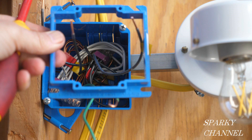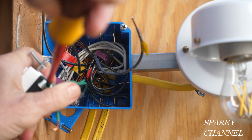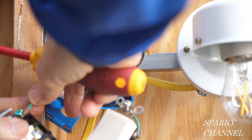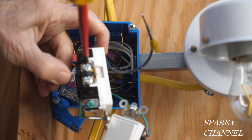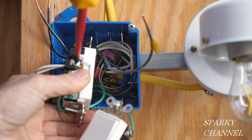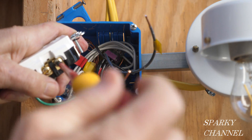At this time I would usually put it on the mud ring, but I'll hold off to increase visibility for the viewers. This is a Leviton Decora Plus single-pole switch. First I'll attach one of the green grounding pigtails to the switch and fasten it securely. Then I'll attach the other green grounding pigtail to the receptacle and tighten it down securely. Next I'll attach the neutral wire to the silver neutral terminal of the receptacle and tighten it down securely with the back wire system.